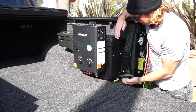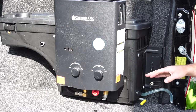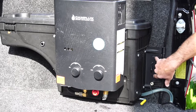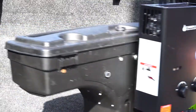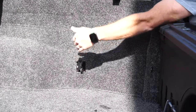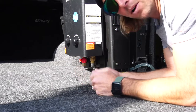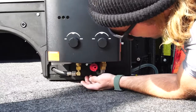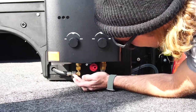With this swing-away mount, if I take the lock off it just lifts up and pops out of the truck — I could probably do it in under a minute. The swing-out toolbox uses a hinge bolted onto the bed rail, and it comes with instructions for the installation. The swing-out system took me about 15 minutes; there's an arm that extends underneath the carpet system with two more bolts that allow it to catch and shut properly.